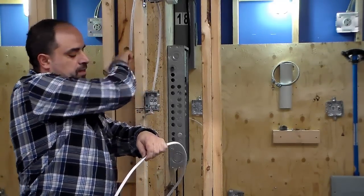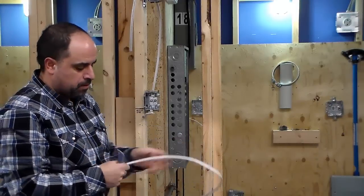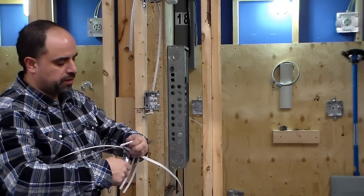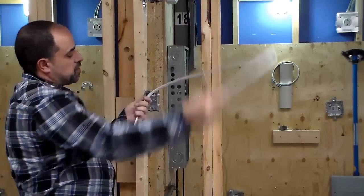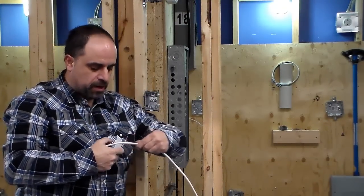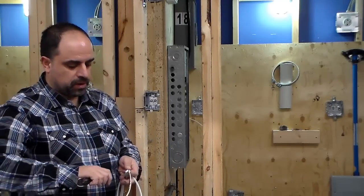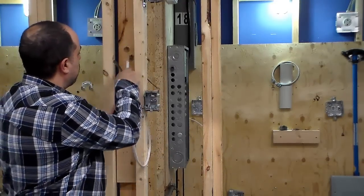I'm going to work and strip my cables to expose the black and white wires. This is the cable coming from the panel. I'm just using a regular electrician hook knife. I can do the same with the wires coming here — once again 10 inches — get the cable ready before I put them in the box. I'll strip both sides, one side for the 1104 box and then the other side for the octagon box.